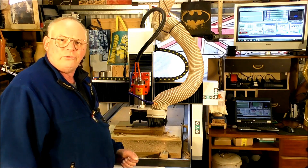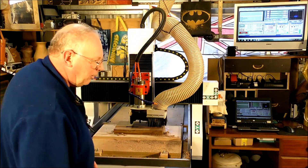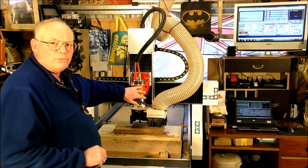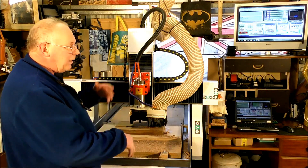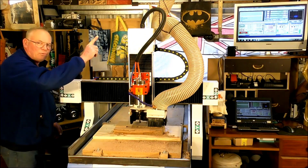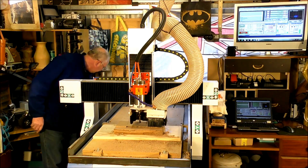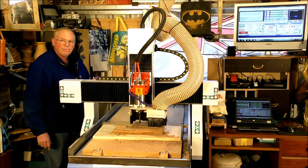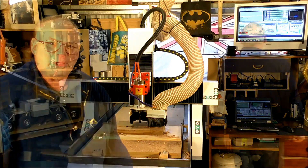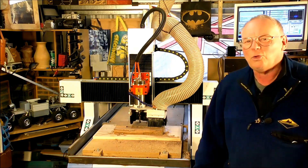Well, by accident I've just found out what the problem is — I've never heard of it before. I'm just going to go and switch the coolant pump on, which is external of the machine. Just have a listen to what Mach 3 says about it a few seconds after I turn it on. Voila! And the message reads: 'External device not responding.'